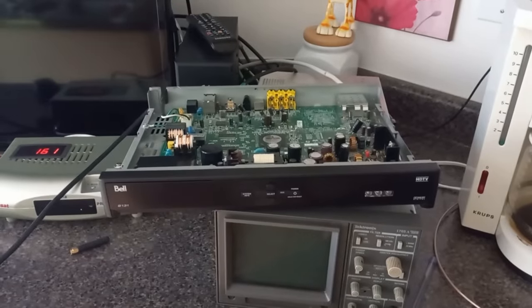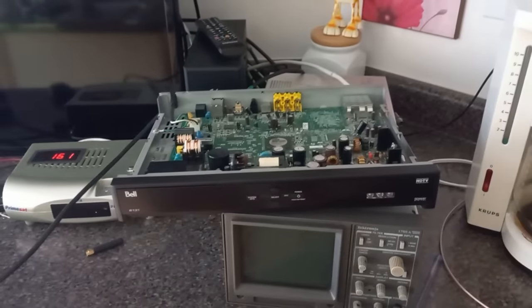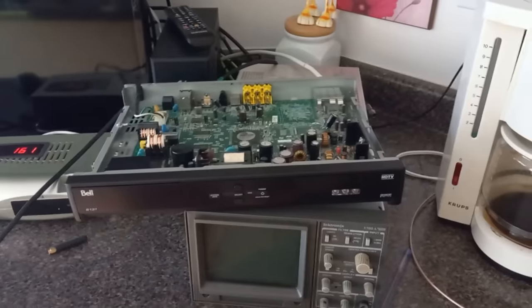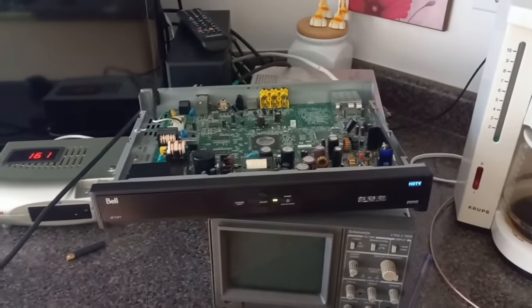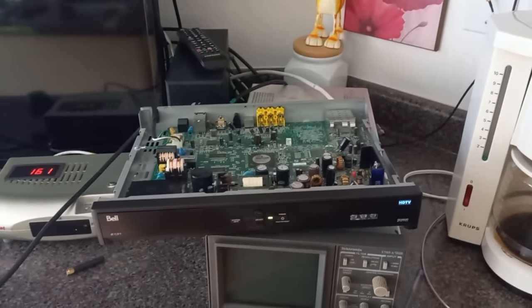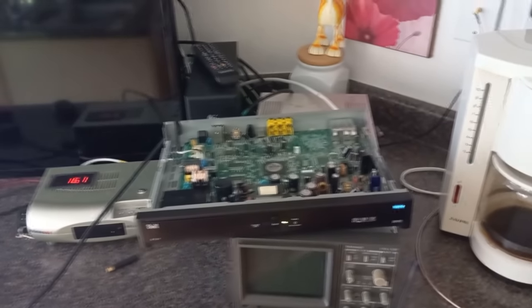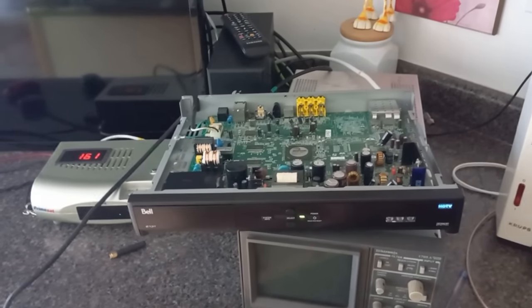Yeah, so with capacitors, if they're already bad or going bad, and then you don't use the equipment for a very long time, the capacitors have an electrolytic chemical inside them, which when it's not energized, it actually will get worse over time. However, when you do use or leave bad capacitors for a while, sometimes they reform and they actually start to work again. Anyways, it's much better. I can already see this is responding much quicker and better. Well, you've even got that blue light on the side. I did not see that before.